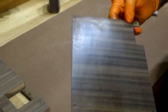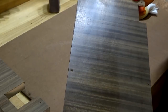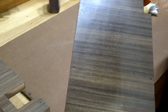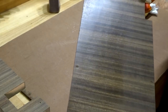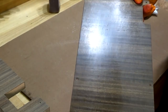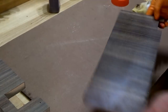The coating that we're putting on now is called bodying up, so we're building up the layers of shellac. In the early stages, you can just keep working on this continuously. Then as it gets thicker and thicker, you've got to leave it aside maybe for 10, 15, 20 minutes, depending on how long you've been working on it. Give it a very, very light sand back and keep going. Okay, but that's essentially the process we're going to use.